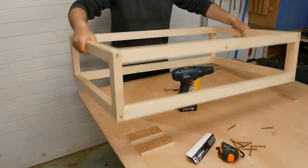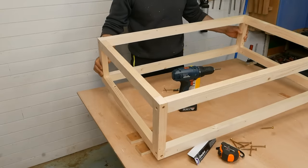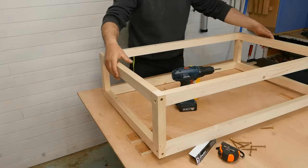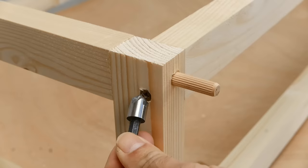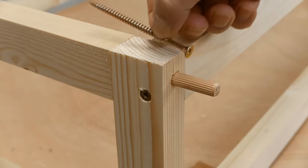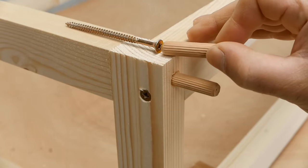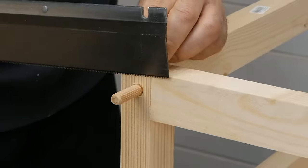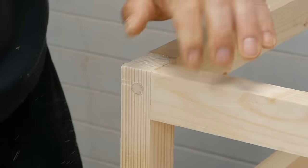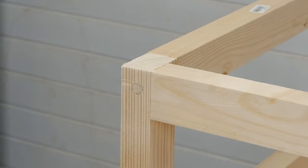And here I have this simple wooden frame. I will use it to make a protection for some seed beds — I just have to put some kind of net on the top and all around. But I think I could also use this system to make some piece of furniture. Instead of countersinking the holes, I would drill them to insert the screw heads inside the wood, then glue some dowels in the holes, and after the glue dries, cut and sand the dowels. I think it would look quite nice.